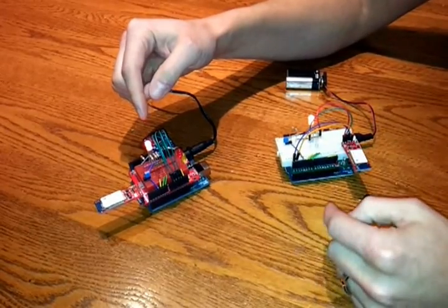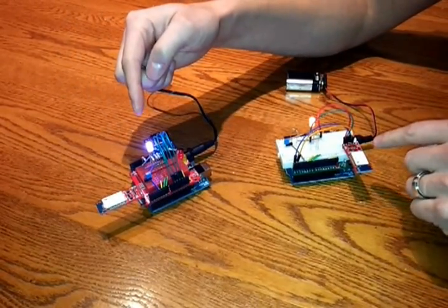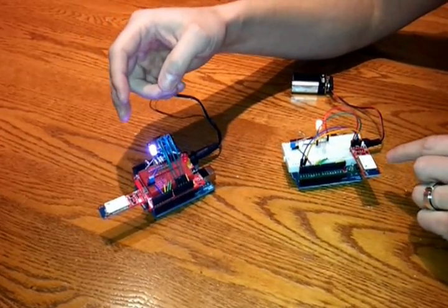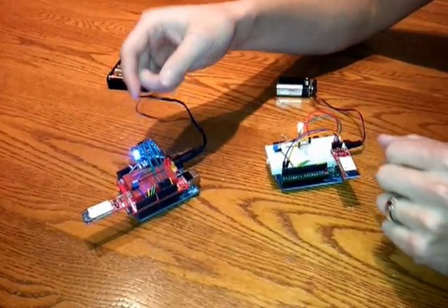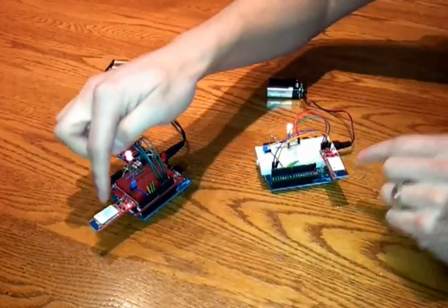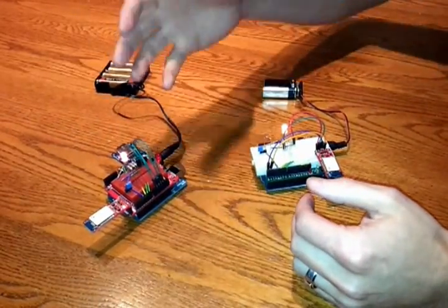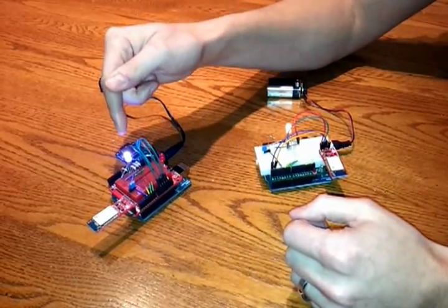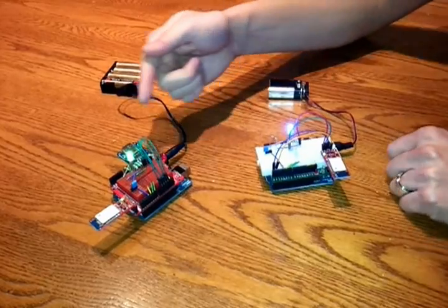But it's also going to get this one. It has two IDs that are known, and once it finds one of those IDs — I'm going to reset it because it didn't find it this time. Once it finds one of the two known Bluetooth device IDs, it connects the link. If it finds other IDs it doesn't recognize, it ignores them. Now it found something and recognized the ID, so the link is done.